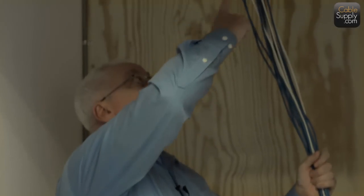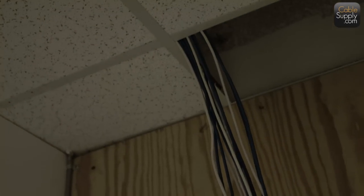Okay. And as you can see, the cable's going up, and this is where we're pulling from. So we're pulling from here. And in reality, if you want an easier pull, if we're pulling really far, this is where you would put your pulley. Little pulleys from Jameson, second man pulley, really makes it a lot easier to pull. They've decided not to do it because all the runs are relatively short.